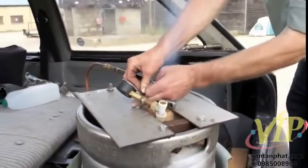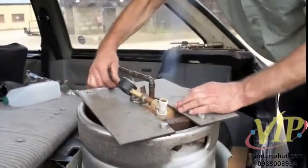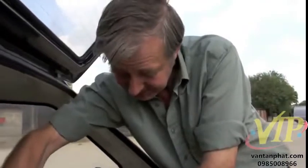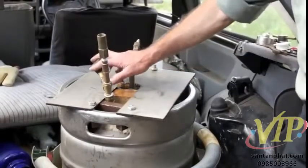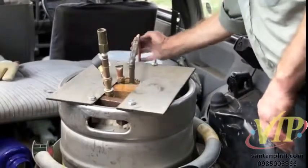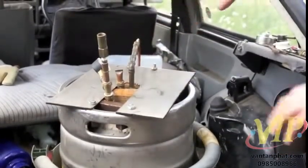Now sealing the tank up to build up to the pressure. We have to do this because we're running on a pressurised system. I put a small amount of liquid nitrogen in here. The pressure then builds up and when I open the valve at the front, it flows along this pipe here and under the car through a system of pipes where it gains heat.